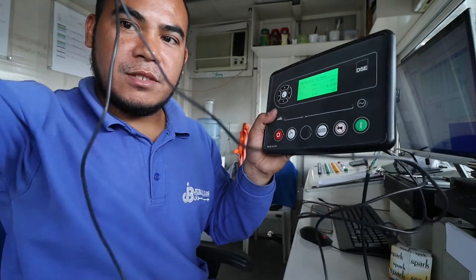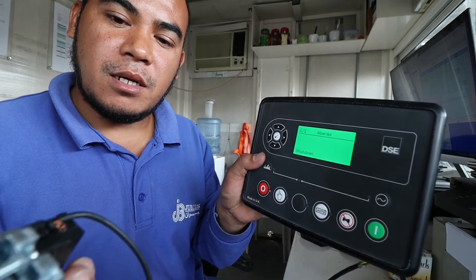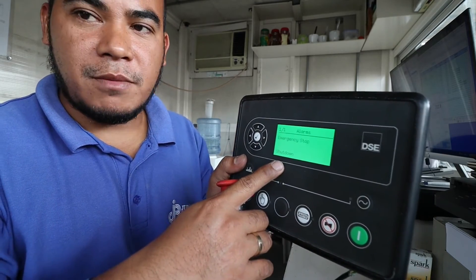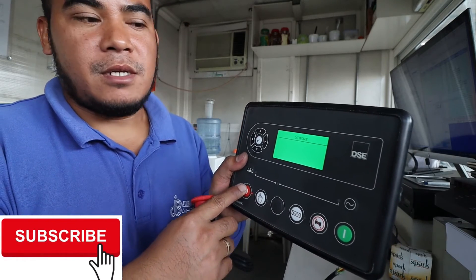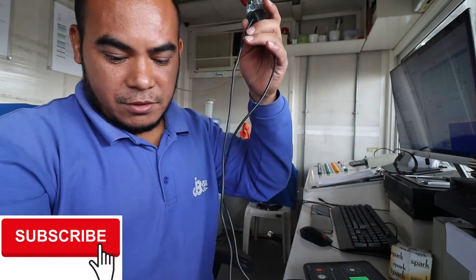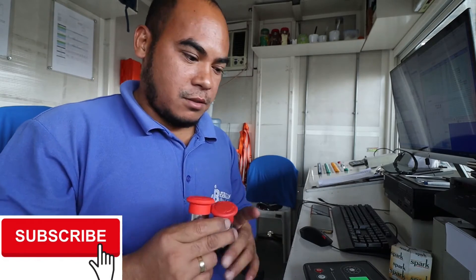This is number one and this one is number two — acting as your canopy emergency stop. If you press either one, it will activate the emergency stop. Any of the two emergency stops, if it becomes normally open, will appear as an emergency stop alarm and the engine will not start unless you release and reset it. The generator is now at rest and available. That is the connections for the emergency stop — very simple, connected in series with positive supply of 24V or 12V DC.